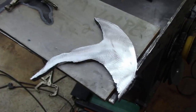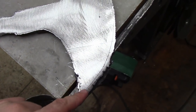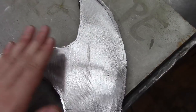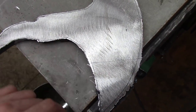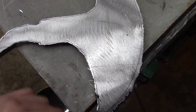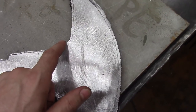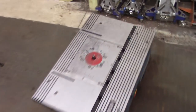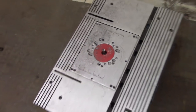I cleaned up the plate with some sandpaper so I could re-mark it and actually see where I marked it. I kept a pretty good gap on the end here — I did check before I ground up the surface to make sure I didn't have any heat discoloration this far back, and I did not. I've got a lot of material, especially back here, to remove. I'm probably going to rough it with angle grinders, then a grinding disc, then sanding disc, and then use my router table with a carbide bit to make a perfect 90-degree edge.